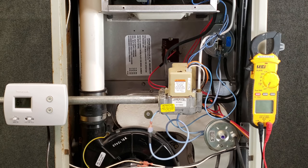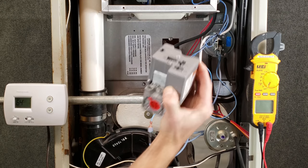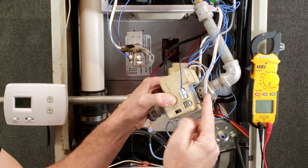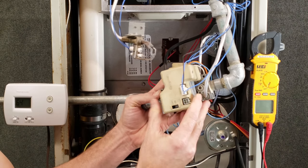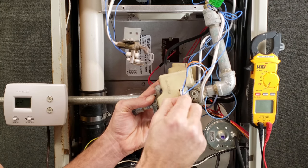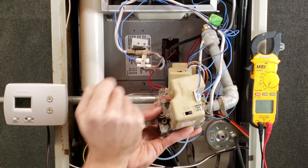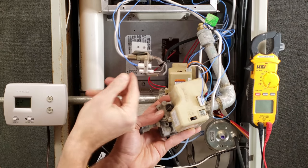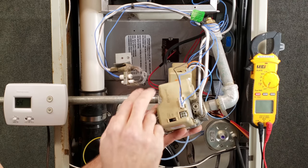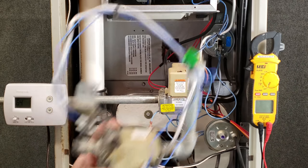There are several types of smart valves. This one is a direct ignition type and this one is a pilot ignition smart valve, which is the most common that you end up finding in the field. You have your three wires right here for your ignition, which is up here — a 24 volt hot surface igniter, a small flame rod, and the flame rod has this black wire on it. This gas valve is actually controlling the ignition, with a control board mounted on top of the gas valve.